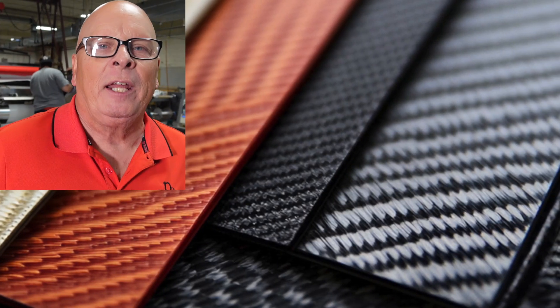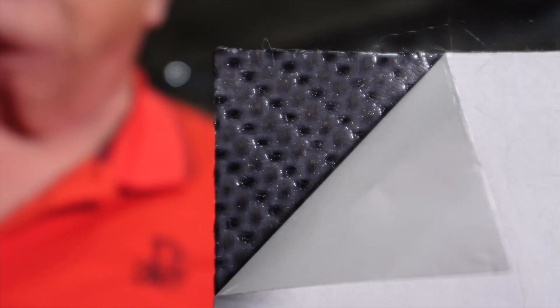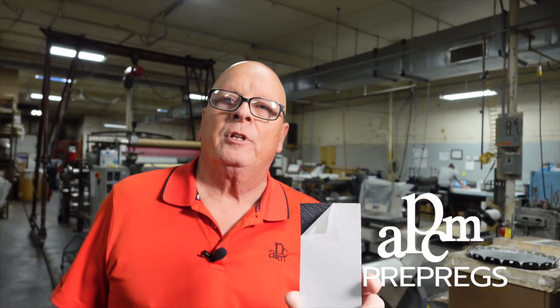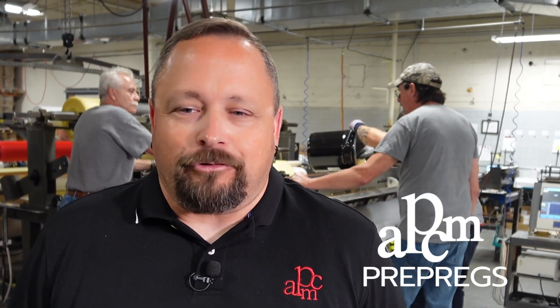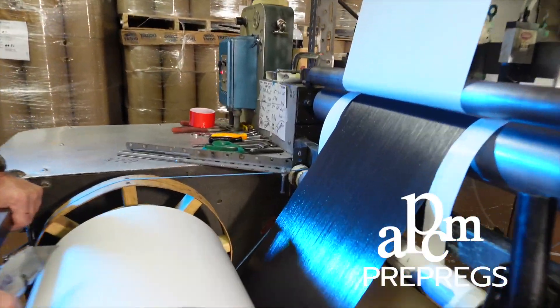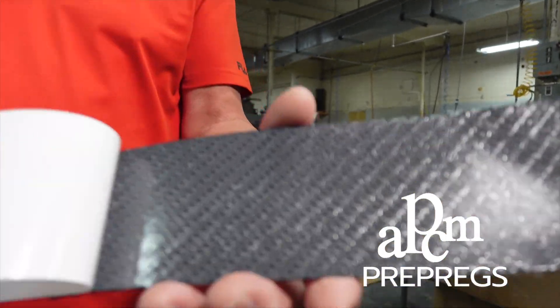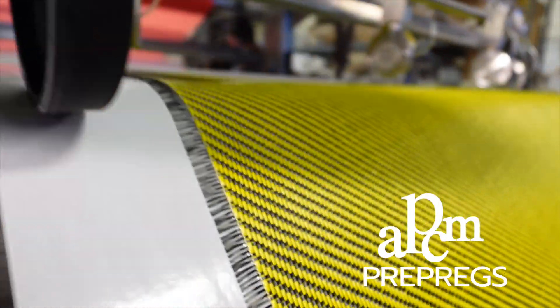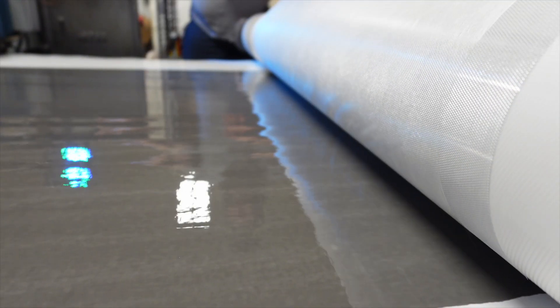Do you use any pre-impregnated substrates for your composite requirements? This is a pre-impregnated carbon fiber fabric epoxy coated material known as a pre-preg — it just stands for pre-impregnation. The fiber and the resin system are as one when you get it. You have the exact amount of resin exactly where it's required, so the customer just peels it and inserts it into the mold — no waiting for resin infusion, no bucket and brush, no spraying.